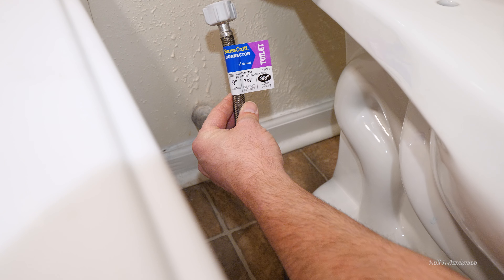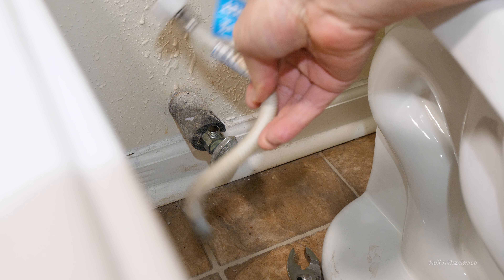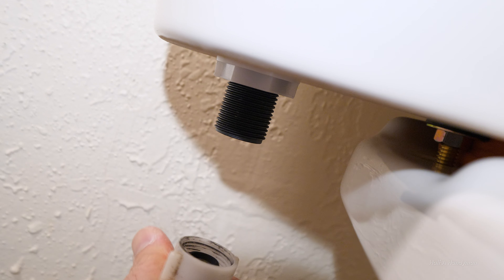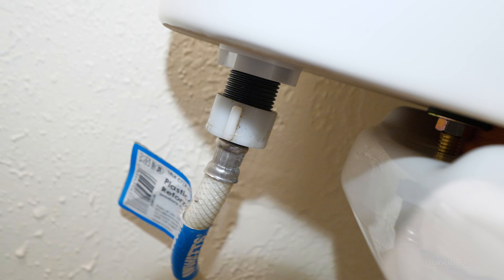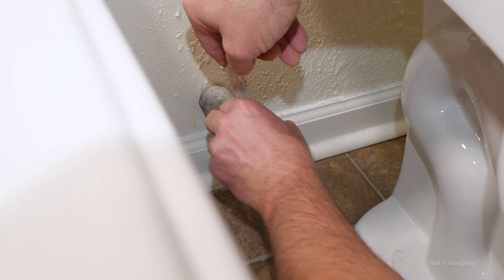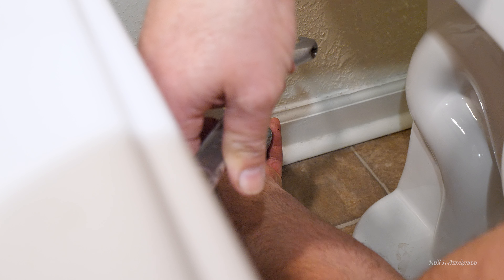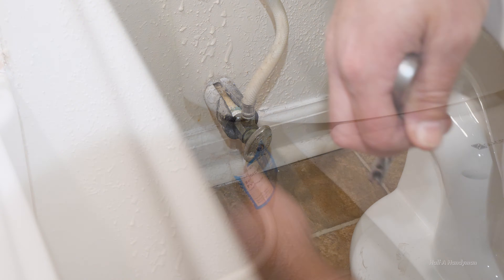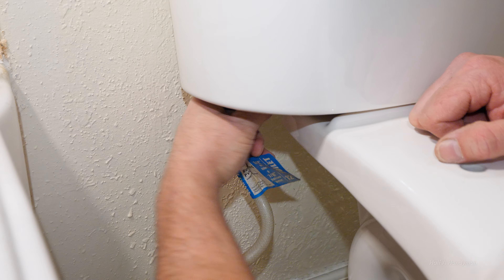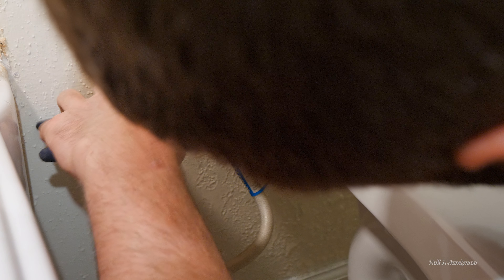My intention was to replace the old hose, but due to a lapse of judgment I got the wrong size — so I'll just use the old one. First, you're going to want to snug it up and then back off a little bit so the hose can spin freely so you can get the other side on. Same thing here, then tighten it up. Remember to hold that valve, as that copper pipe coming out of the wall could easily bend with enough force. Give it the old hand tighten, and if you feel it's necessary use a pair of pliers, but don't get too crazy with it as they're both just plastic.